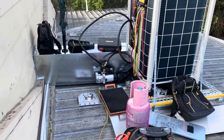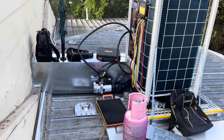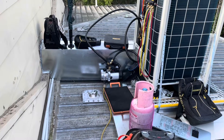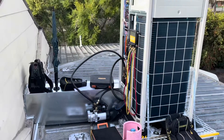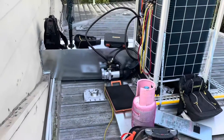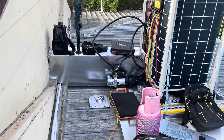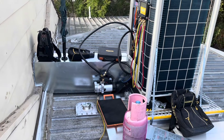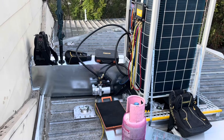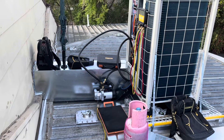We're back — it is Friday, December 2nd. I left it under vac overnight, so I packed up the vacuum pump and all that. There was a potential it could have rained, but it was actually a lovely night. We're just going to vac it out again — it held. It bounced up to around 240 microns, so just pull it back down again. Then we will get ready to charge and set the addresses on the indoors.